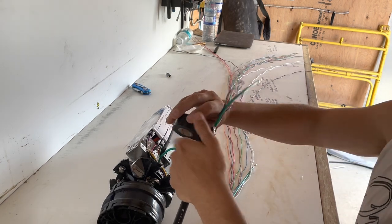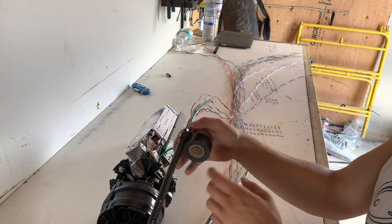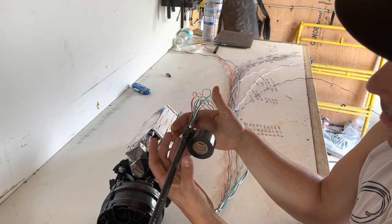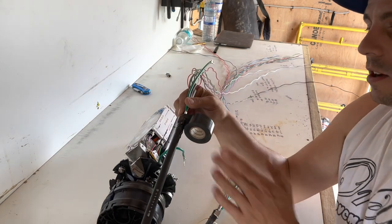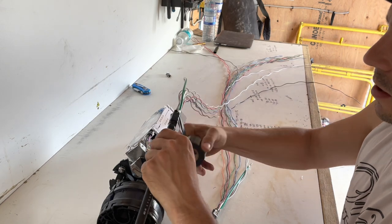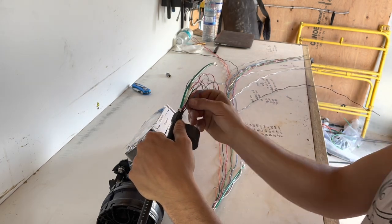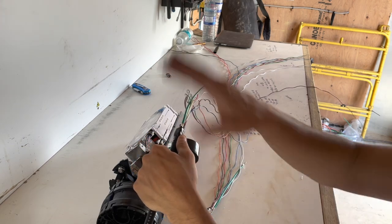Now, when taping this, you want to be snug but not too tight. If you crank the tape down on this, there's a likelihood, and I've run into it on networks before that other people have built. You find a loss in the network, and you think it's a splice loss, you go resplice it, it doesn't change the loss. You end up finding the loss being down here. Someone has cranked this down way too tight with their tape, causing it to force in on that inner tube here, pinching these tubes on the inside of here. I've literally gone in there and these were pinched right flat. Came in there with my little needle nose pliers, pinched the tube back open, boom, loss was gone.